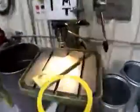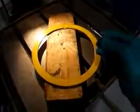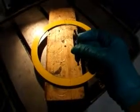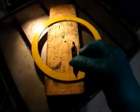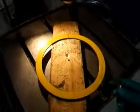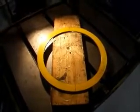I'll just go over to the drill press here. I think you'll see in the first video I like using these center drills for starting holes. You don't need a center punch, they're very stable, and the one I got in there's big enough I won't have to drill another hole. So I'm going to go ahead and drill those holes, and we'll go to the next step.